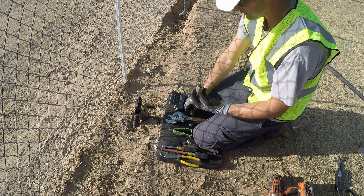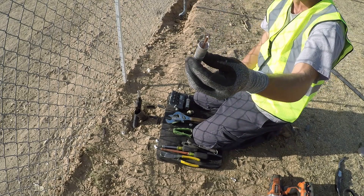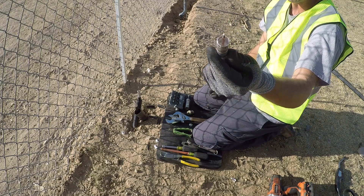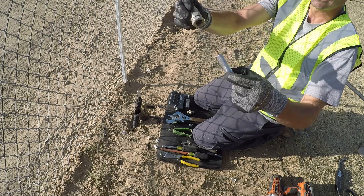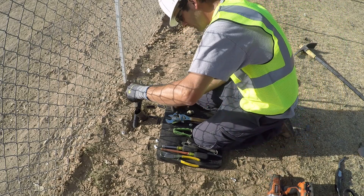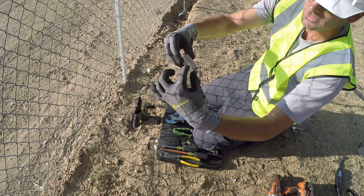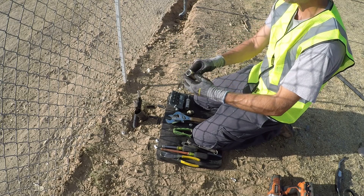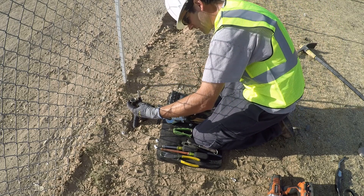Take the pin connectors apart. If you want to see what the cored cable looks like, here's a close-up — you can see it's essentially a 75-ohm cable, just bigger than the one you'd hook to the back of the TV. It's proportionately bigger to remain 75 ohms. It just cores down in there so the connector goes together and slides up inside. There are cut marks on these connectors — comparing from there to the bottom of this edge tells you how long the center conductor should be. For this particular connector, as long as you bottom it out all the way, you should be able to cut it flush.